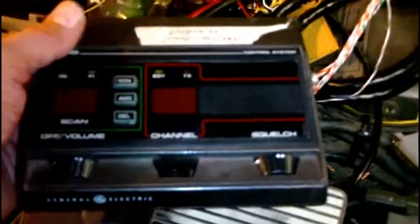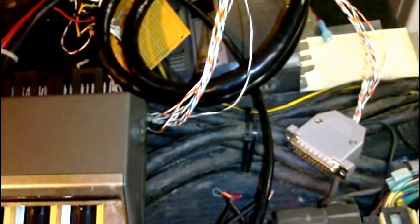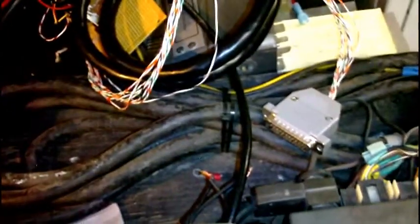The control cable is about 15 feet long. They made a number of control heads that are pretty much interchangeable. I believe this is an S600 — it's an eight-channel control head. This is a 550, which is a parts unit. It has a scan capability on the head. They also made an 850 that could do something like 128 channels — eight banks of 16 channels each — and it would download the chip in the radio each time you changed to a different bank.